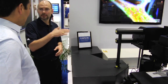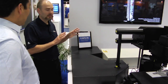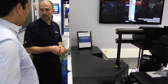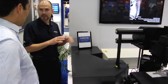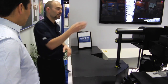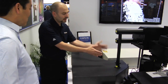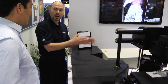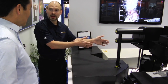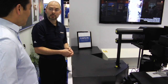We've taken care of all of that — whether you're tuning the laser back and forth to different wavelengths or using a two-laser system. We've always been able to use two lasers on a system — we call these twin laser systems. With this particular system, not only can you use the main laser for imaging and the second laser for two-photon stimulation, but we can also combine both of those lasers in the same light path. So you can do two-color optimized multi-photon excitation experiments, either simultaneously or by rapidly switching between laser lines, since each laser line is controlled by an Acousto-Optic Modulator.